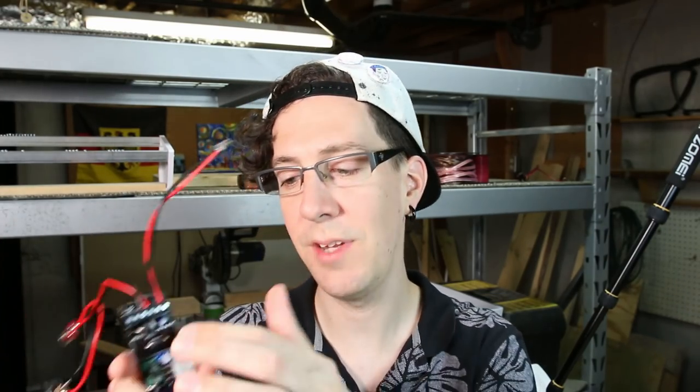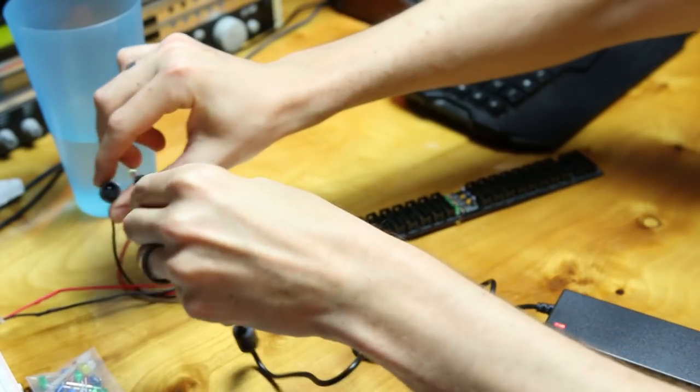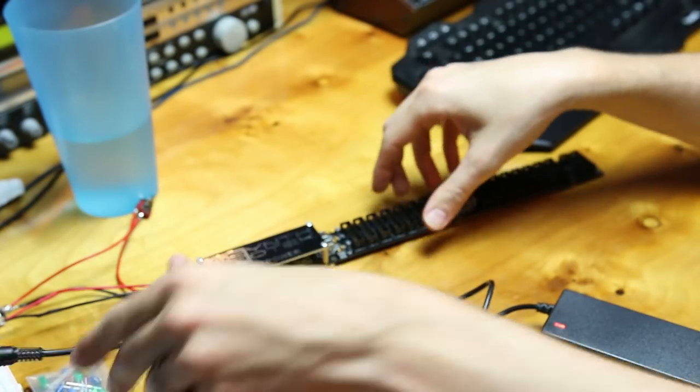What we're doing is a bit of a hack — leaving the 12 volt rail unregulated and using a diode to bridge the connection. I think I've either got this right and I'm reading it incorrectly, or something's wrong and I'm still having trouble troubleshooting. All three LEDs are supposed to light up when you plug it in, but from my testing I can only get the 5 volt and the 12 volt positive to light up. The 12 volt negative won't light up. I've gone over every single solder point with a fine-tooth comb.